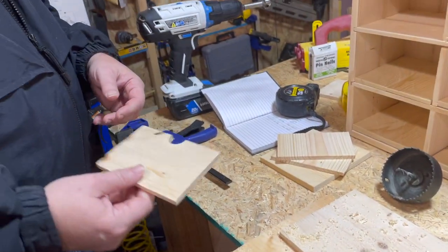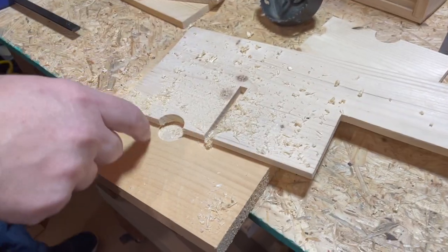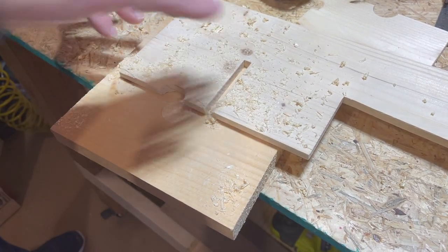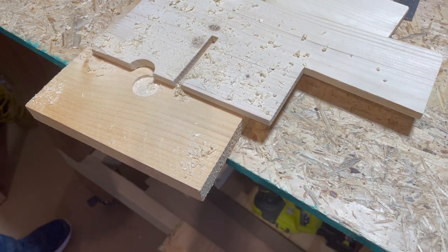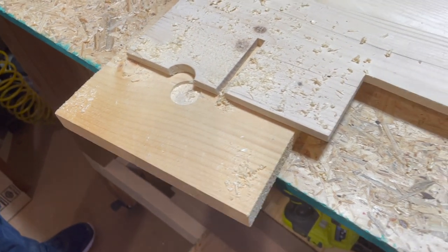It just removes a little bit of wood. What we did here was a little jig because the Forstner bit requires to be straight - if we're putting pressure on only one side it will want to drift. This is something that last week we damaged - we had the F-damage - and this worked beautifully. Again, we use a backer board because of the Forstner bit going through.